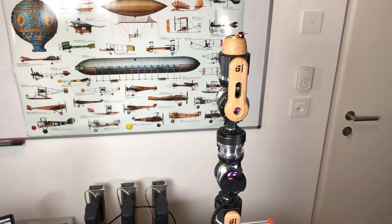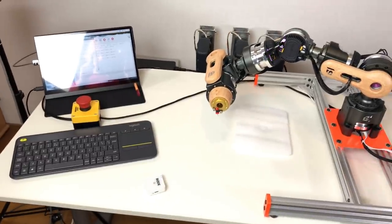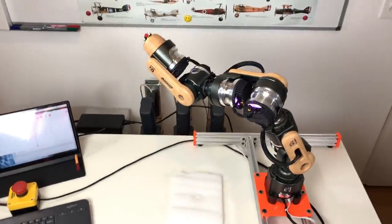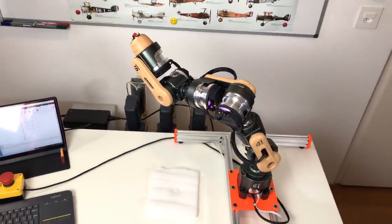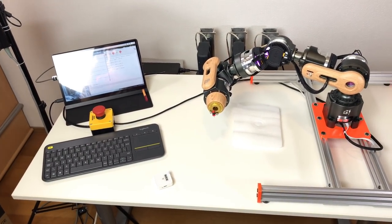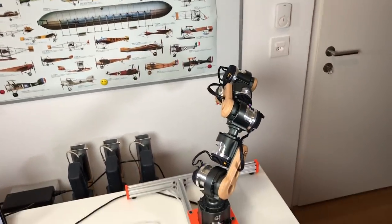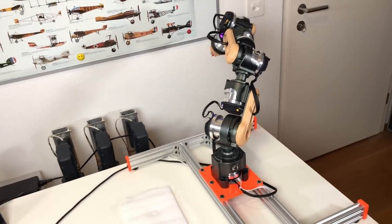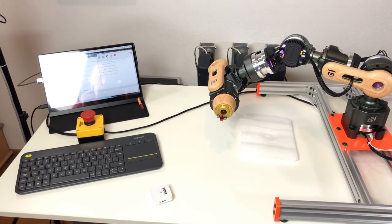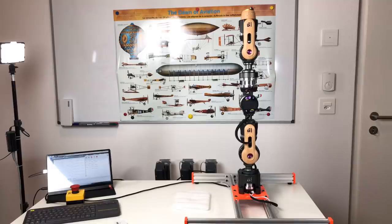Also, with this setup, with this Python module, I can fix one position, this one. So this is going to be position number 1. Move the robot arm from this position to another position, like for example this one, which we will call X position. After, we will move it back to position number 1. After that, to another random position, let's call it Y position, this one. And afterwards we go back to exactly the same position number one. So like this, we can test the repeatability. So we can check that every time position number one is exactly the same position.